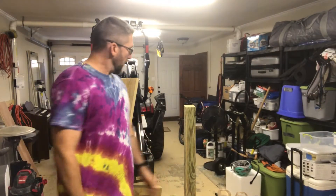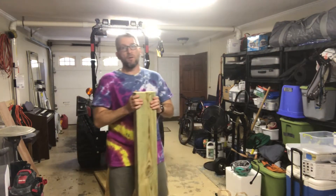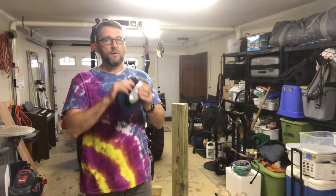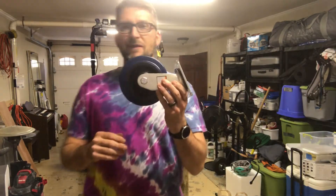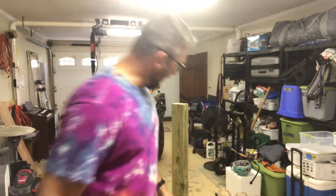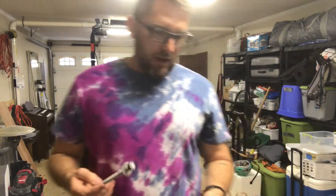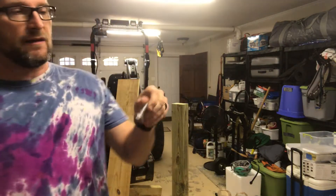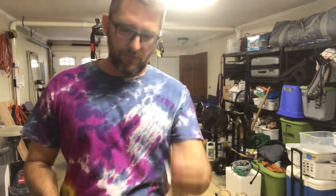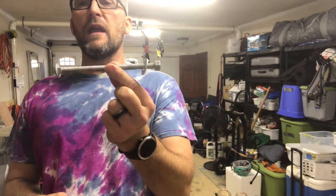The materials on this are actually pretty easy. We'll start with a 2x10x10 foot board. I did have to buy treated lumber in the 4x6 — I bought an 8 footer. I went to Harbor Freight and bought wheels based on two things: number one, they're tall. These are the 6-inch heavy duty swivel casters. I got two that are swivel and two that are not. For hardware, I'm using galvanized 3/8-inch with a washer — 3/8-inch washer on every single one. I got 16 of those and eight 6-inch long 3/8-inch carriage bolts.